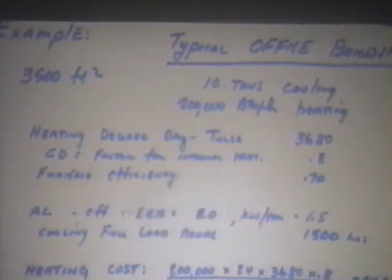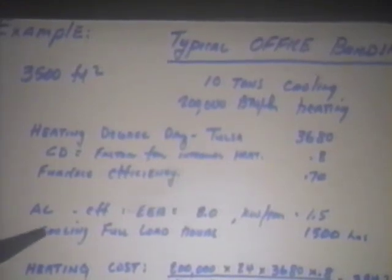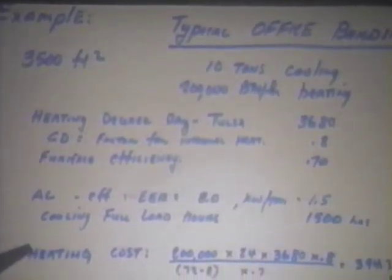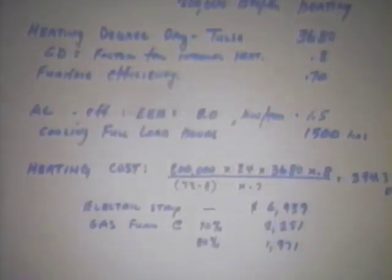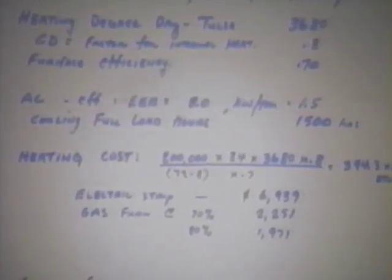Furnace efficiency, 0.7 or 70%. I'm going to use an air conditioning efficiency EER of 8, which translates to 1.5 kW per ton. I'm going to say that it has a cooling full load hours of 1,500, and that could be just as easily 2,000 or 2,500, depending on how you use the building. But for this example,